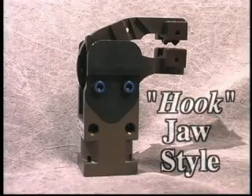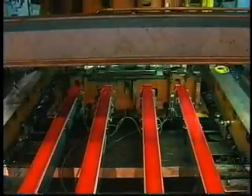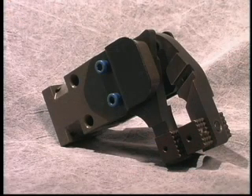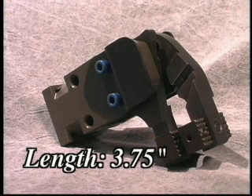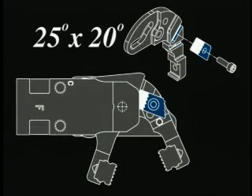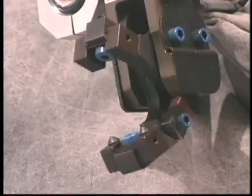Working in confined short spaces is the attribute of yet another Series GRM jaw style. The hook style offers the shortest overall length of any conventional clamp on the market. Why would you want to clamp this short? If your goal is to run panels faster, many stampers accomplish this by running larger panels in smaller presses because of their higher cycle rates. You'll need to reduce tooling arm or clamp lengths to gain the needed clearance between the die and the rail. PHD's hook jaw clamp has an overall length of just 3.75 inches. This is much shorter than other conventional clamps. Like the rest of the GRM product line, the hook jaw offers adjustable jaw rotations of 50 by 40 degrees, 25 by 20 degrees, and 50 by 0 degrees, giving you expanded clearance options in getting the jaws out of the way of moving dies.